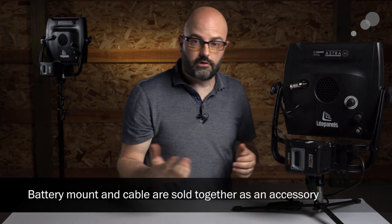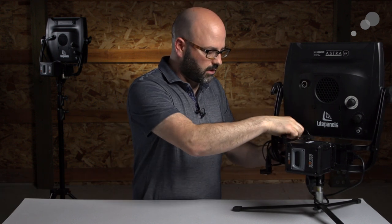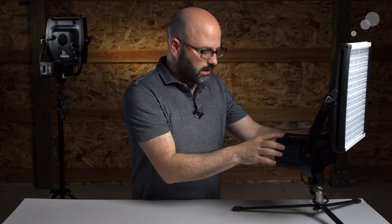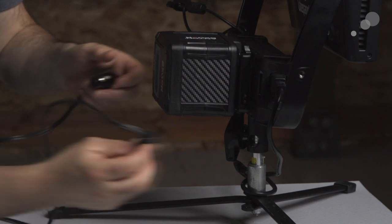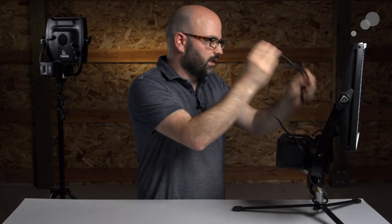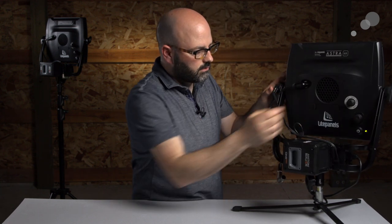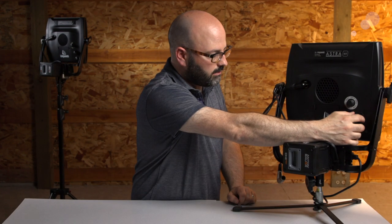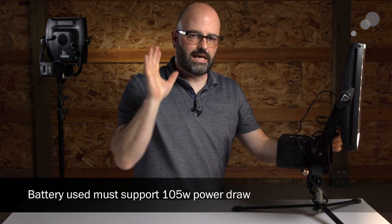In terms of battery powering this unit, it's very simple. You attach the battery — whether V-mount or AB gold mount — detach the XLR plug from mains, and there is a P-tap or D-tap cable that goes right back into the adapter on the back of the unit. Once attached, that plugs in as a three-pin XLR into the back of the unit, you turn the fixture on, and you are battery powered. The output in battery power is the same as when powering off mains.